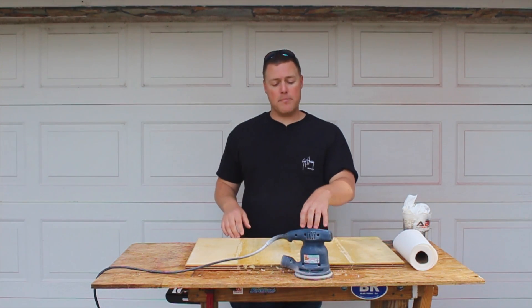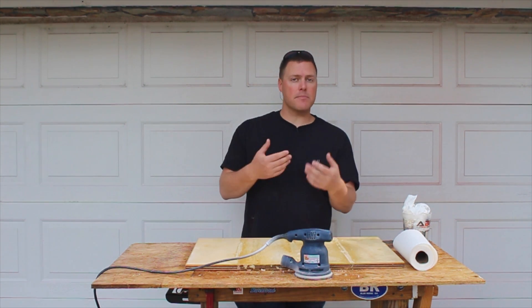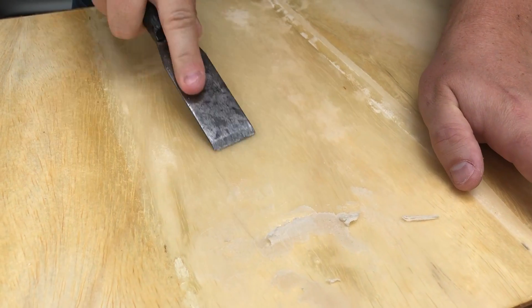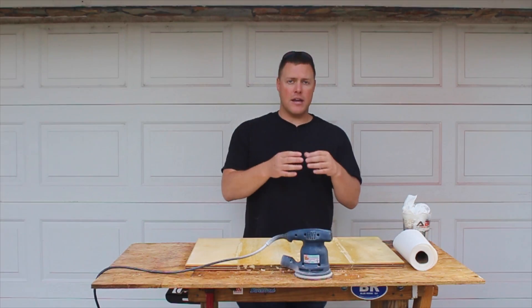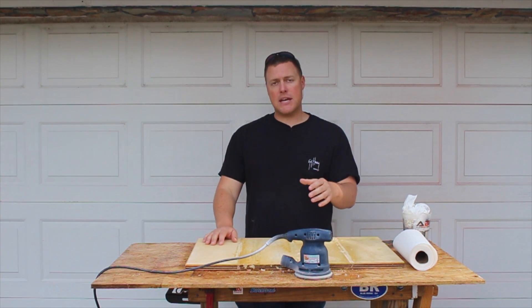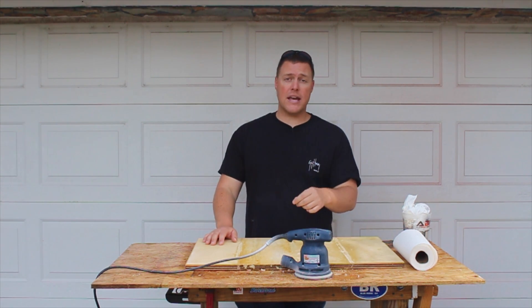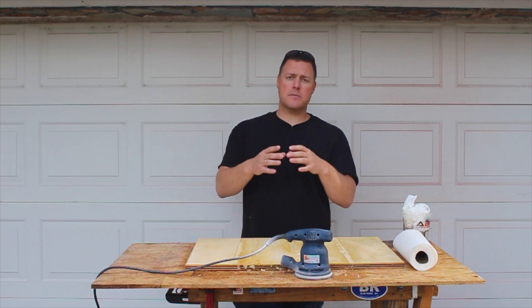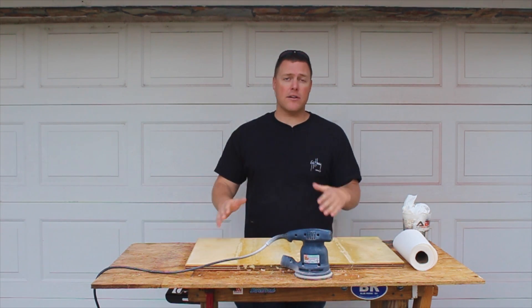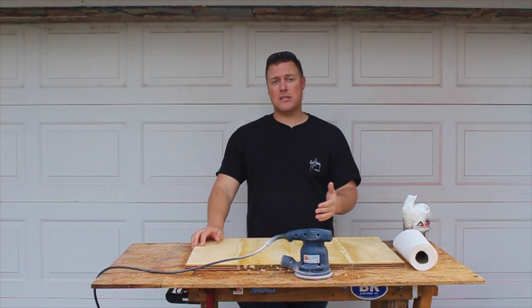This section we poured two-to-one base resin seemed fine until we hit it with a sander and it was almost rubbery — it wasn't properly cured. If a section is rubbery, you need to scrape it down before sanding because a sander won't work on a rubbery or liquid surface. Scrape it down as best as possible, sand it, clean it up, and then re-pour. You can re-pour the entire project or just the affected area — since epoxy self-levels, it will flow out and you won't be able to see the seam.